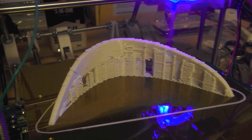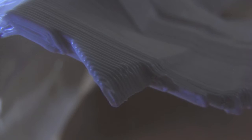In the interest of speed, I printed this with a 0.5mm layer height, which is quite thick. The default setting I generally use is 0.3mm, and you can go quite a lot further down. But 0.5mm is a large layer height. This whole print, from my first idea right through to the actual wearable thing, took about one week, which is pretty good.